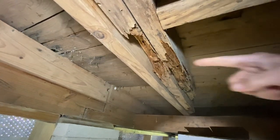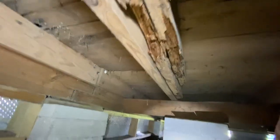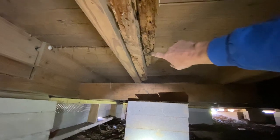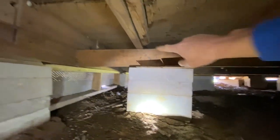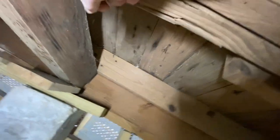What that's sitting next to is a new two by six floor joist sistered to it. So you can tell now here we've got a new one, an old one, and a partial old one. Here's the only problem with this sistering: it goes from that sill over here and extends across, but is loose right here, right above me. When I try to tap on this floor joist, you can see it shaking because it doesn't extend all the way across to this sill.